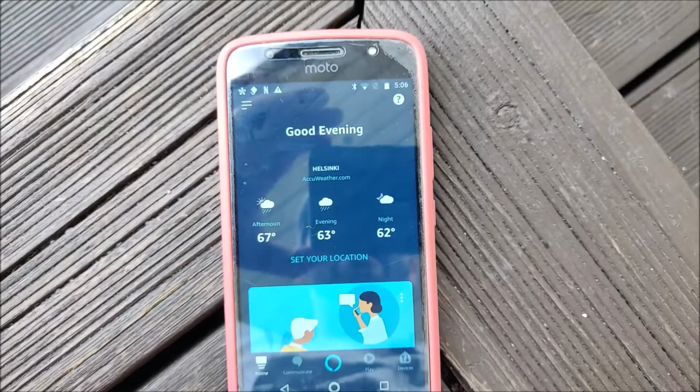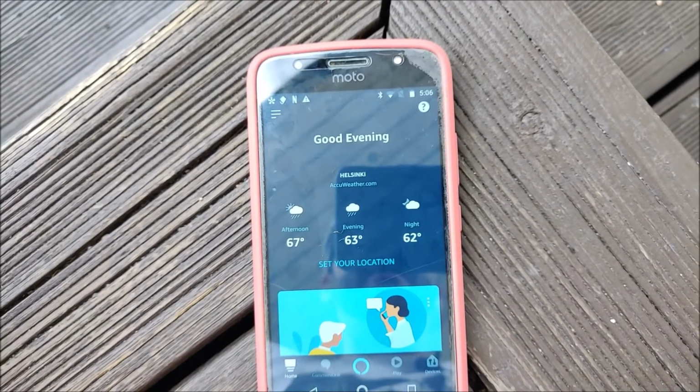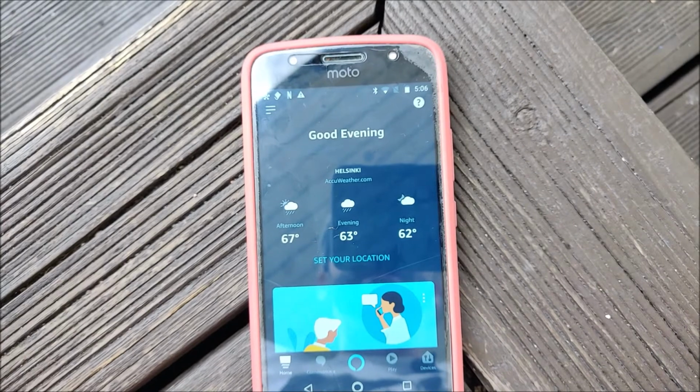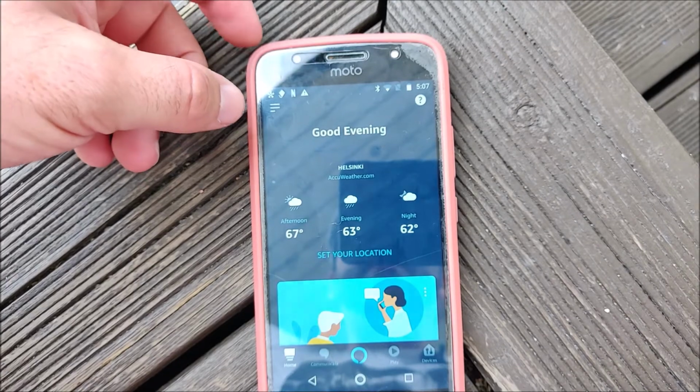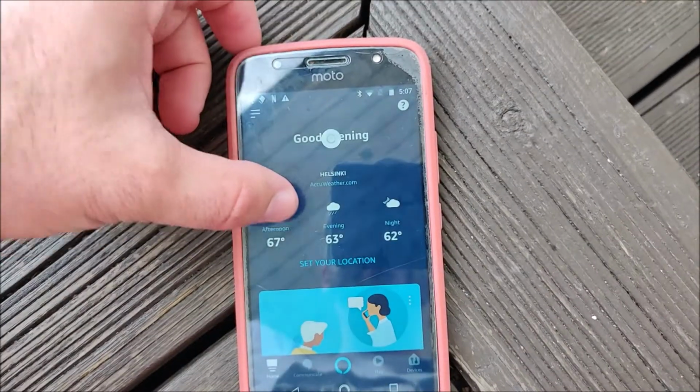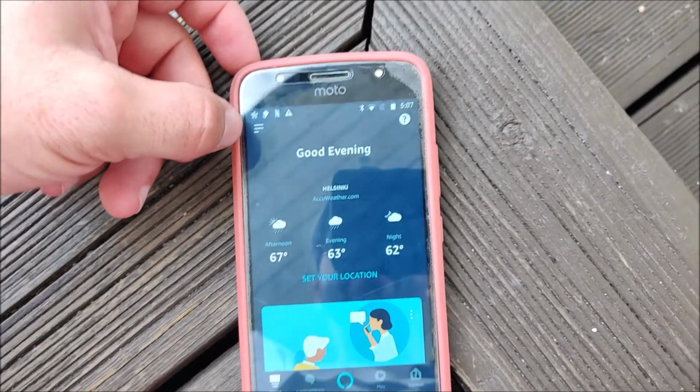Using the Alexa routines is a bit more simple, but the Alexa routines don't have that many options. So for me, it's important to control the lights via the motion sensor only after sunset. So the route I chose is to use the virtual switch. Before this step, I assume you have already set up the Sonoff Touch switch with eWeLink. That's very easy to do. Just follow the Sonoff instructions for that. I can leave some links in the description if you need help with it.